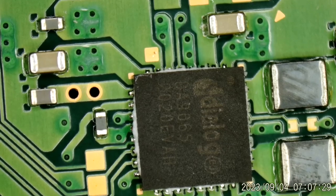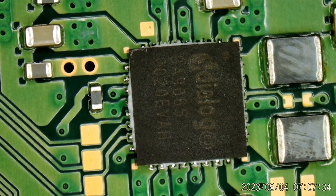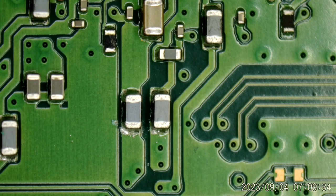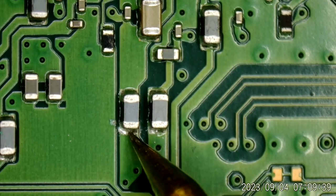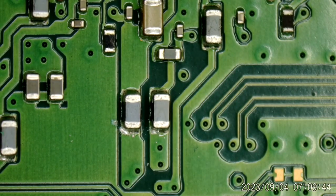I mean, these chips over here can fail. They just don't seem to fail as often as the south bridge does. So, yeah, let's see if we can get that south bridge changed out. Just to make absolutely sure, here's our short. I think I'll lift this coil. I may have to lift another one, but I'll lift this one. Let's just make sure that when I lift it, the short on the supply goes away. No point in changing out that south bridge unless we have to.